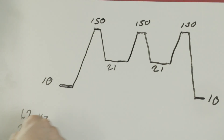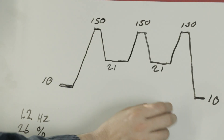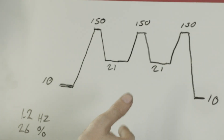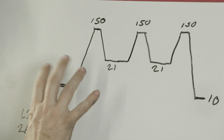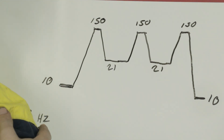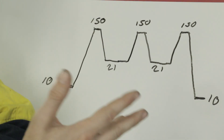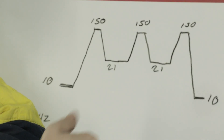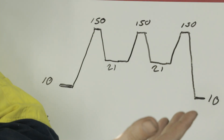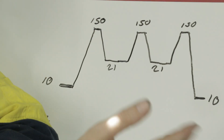So in a nutshell, that's what we're doing. You could spend your entire life on 150 amps, and all you'd ever have to do is change those two values — hertz and percentage — and you could pretty much weld anything. It's not ideal, I'm not saying you should do that, I'm just saying it's possible. To recap: your hertz is your speed, and the percentage of the pulse is how much time you're going to spend on the hot end. When I'm welding 6mm or 12mm stainless steel plate with lots of heavy welds, the machine stayed on 160 amps straight DC with 3.2mm filler wire. You wouldn't even think about pulse welding heavy stuff like that — but when it comes to thin stuff where you don't want over-penetration, this is where it's at.